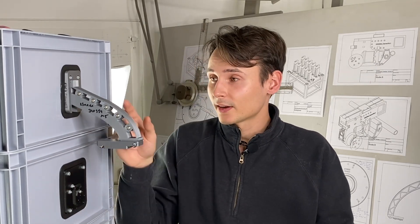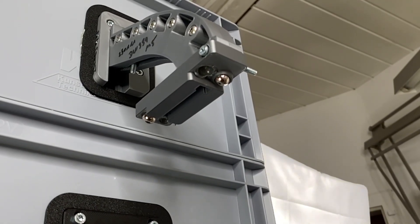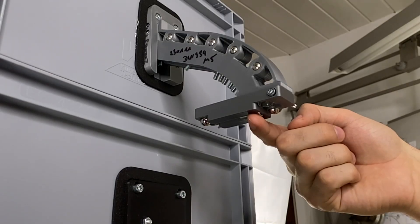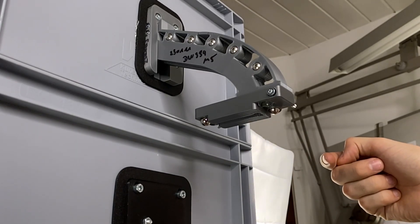This is the main feeder unit. It separates the screws from one another and once separated they go through this redirection path to leave the orientation part fully oriented and completely constrained. This part is one of the most complicated sub-assemblies of the whole system.